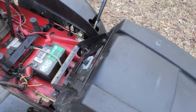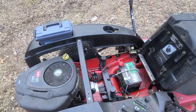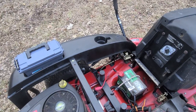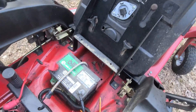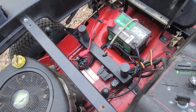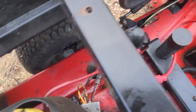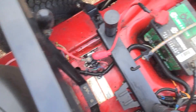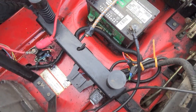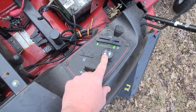Underneath, lots of new parts. I disabled every safety system that this came with, so it can be started, stays started, and the blades keep spinning regardless of whether or not you're on the seat or if these levers are in or out. Originally when I bought it, it would not start at all. So I replaced the starter solenoid, replaced the voltage regulator, replaced the battery with a good battery, and disabled every safety system I could find. It fired right up. The other thing that's brand new is the PTO switch, which was also broken.